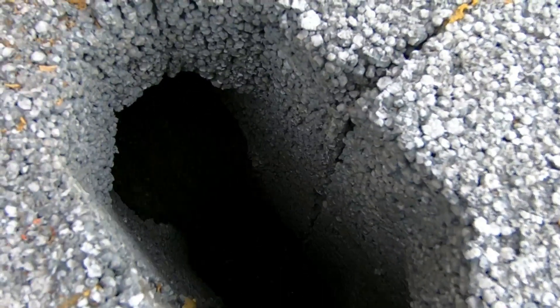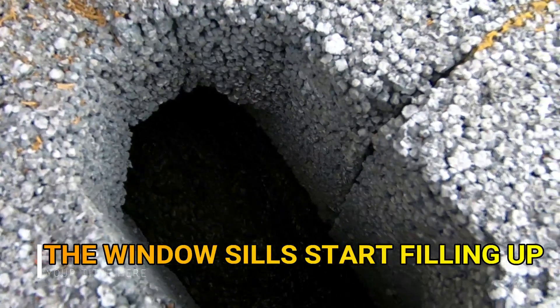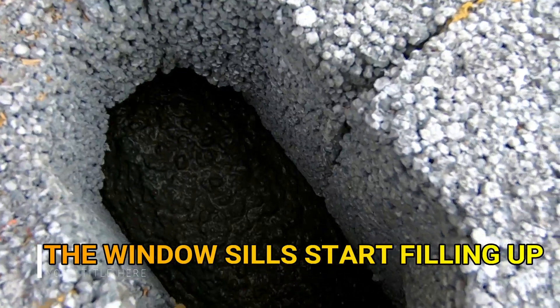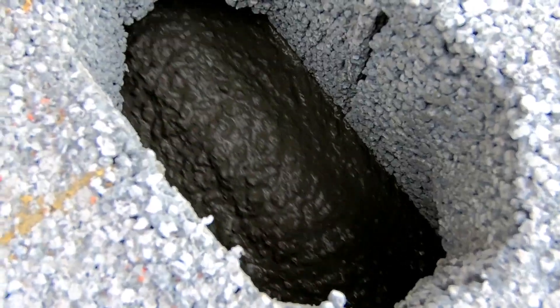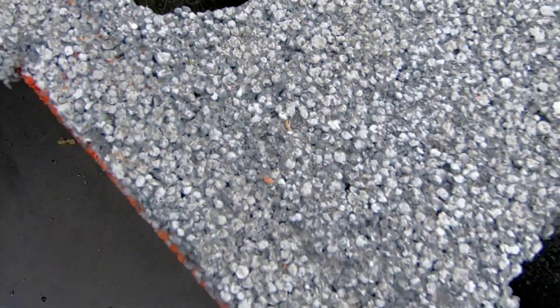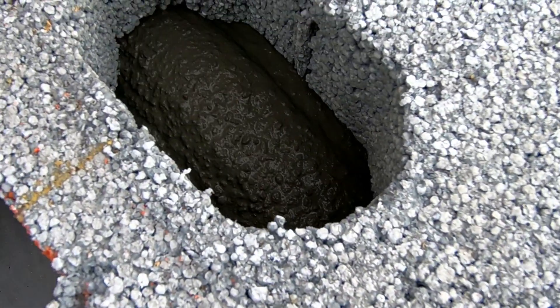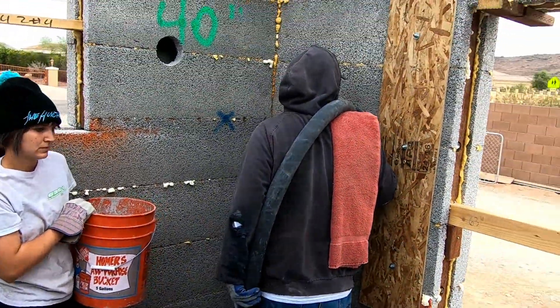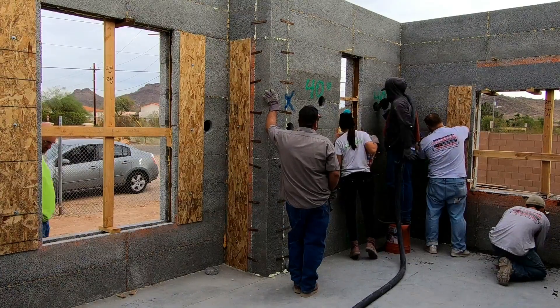Watch what you're going to see here — it's really amazing. Look at this: the windowsill starts filling up and he's up five feet. As you can see, the grout flows through the Perfect Block system's cells just like a river, and that totally avoids any honeycombing, any spots where there's no grout. You're really insured a 100% grout pour.